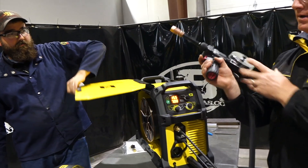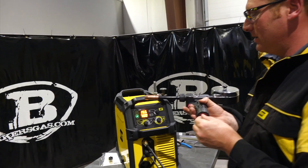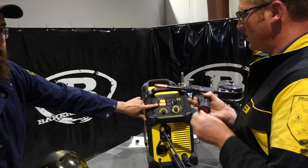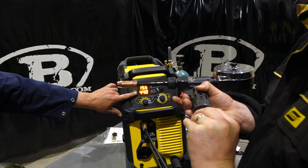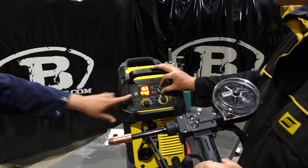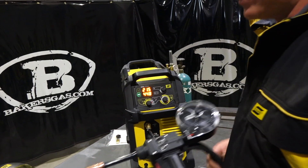So we're going to be at 450 inches a minute and 21 and a half volts. On the spool gun, I now have my wire feed setting on the gun, so I'm going to tune this down — you can see the wire speed changing, it's coming down. 450 inches a minute and 21 and a half volts — I still have to adjust my voltage here. 21 and a half volts. And that's going to get us in the ballpark.